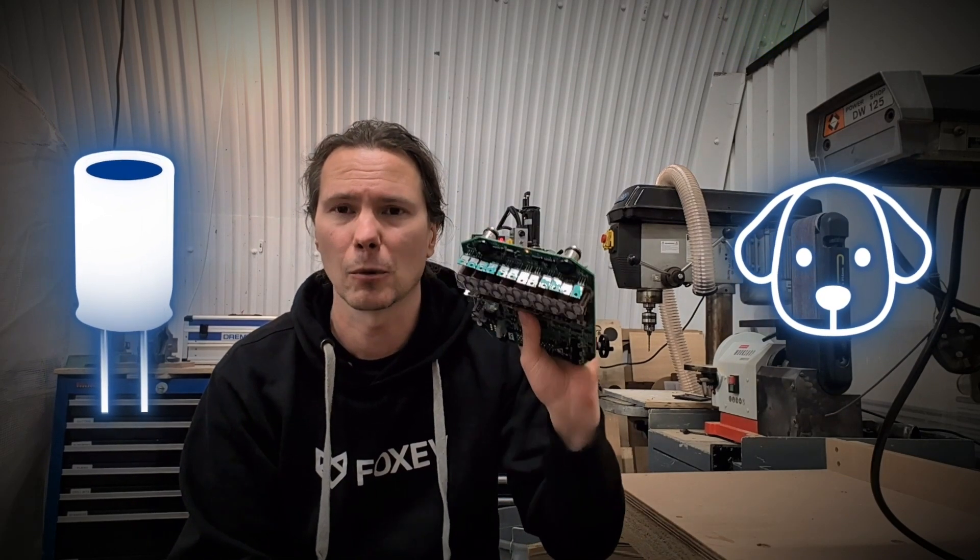Capacitors and dogs — what do they have in common? One, I love both of them. Two, both of them take more than what is good for them sometimes. If you give a dog food, some of them will eat more than is good for them till they make themselves sick. Capacitors have got the same problem. They take more current from a source than is good for them — it will burst them. There's no protection or anything; they will take more charge than what is good for them. You need to protect them, or the inverter needs to protect them.